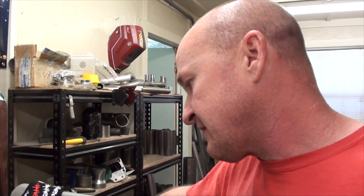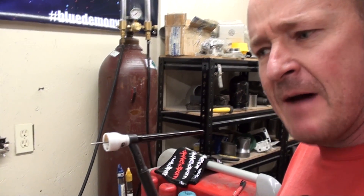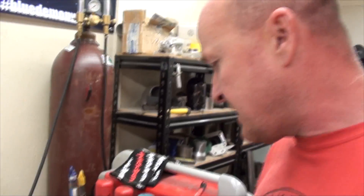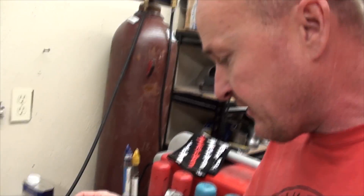The next one up is the ultimate kit, which gets you a stubby gas lens that goes into a large gas cup. I did that because most beginners are going to have a number 17 air-cooled torch — it's just what everything comes with. You get that with a GLS Fab cup. You can get the number 12s or the number 16s — and then I just broke my tungsten on accident.